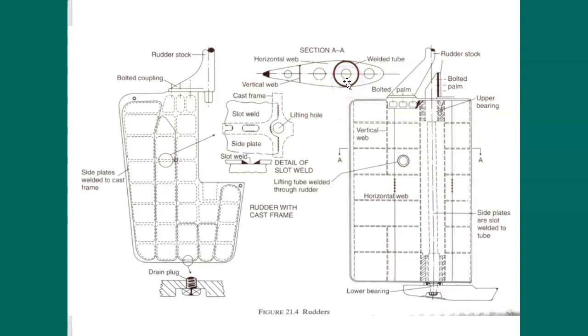This view here is showing the top-down view. You see where it says section AA right there? Put my cursor right on it, it says section AA. If you look carefully, you'll see this line, which says A, comes all the way over here. That's meant to show you on a detailed drawing like this where that bird's eye view slice was taken off that rudder. So it shows you that teardrop shape. And again, that's almost like a wing of an aircraft. Think about how the wing of an aircraft works. I hope that you all understand how an aircraft stays in flight with high pressure and low pressure areas around the wing. And in a very similar way, and we'll talk about this in ship handling in future years, the rudder acts with high pressure and low pressure areas around it as the ship is turning.